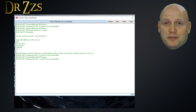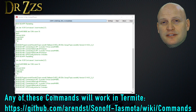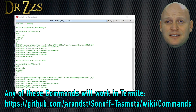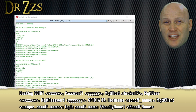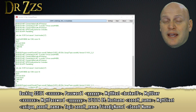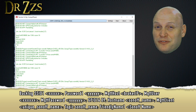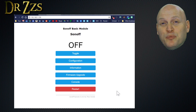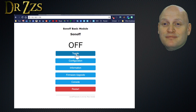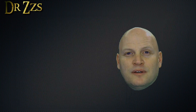You can also type commands down in the box at the bottom — you can type TASMOTA console commands. I have a text file that has all the console commands I need to set up a Sonoff from the beginning: my SSID for my home Wi-Fi, the password, the MQTT broker information, and you can even set things like the topic, the friendly name, and the module type. I'll give you an example of the file that I use so that you can copy it, put your own information in, and paste it in Termite. After putting my information in, it worked — the Sonoff is connected to my Wi-Fi and I can see the IP address. I can put that IP address in my browser and here's my new Sonoff. If I'm using a different module, I can finish the configuration there, but all the most important information I put in with my backlog command in Termite.